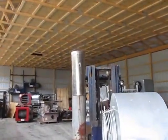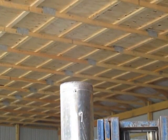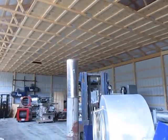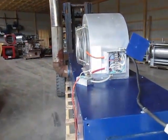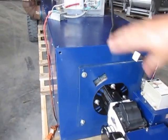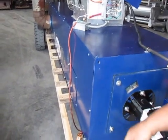Look up here at the stack — this is burning right now with zero smoke, very nice and clean. Refer to our technical help page for a detailed explanation on flame adjustment at centralohioheaters.com. If you get it adjusted right, the chamber inside should burn white to tan and give you a nice clean flame — never black smoke inside the chamber.